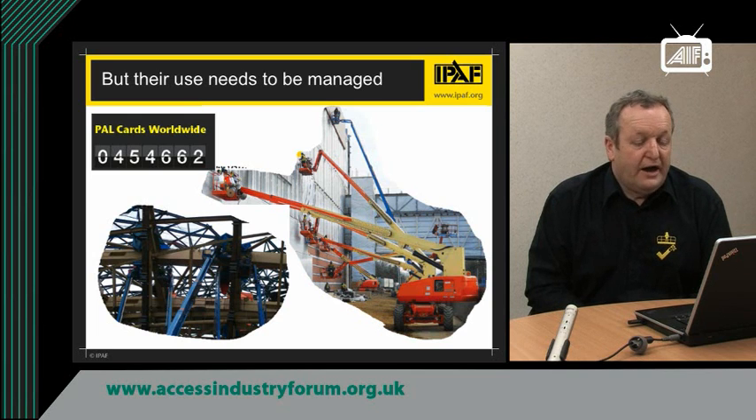The common height of a machine 10–15 years ago used to be about 60–80 feet. It is now 120–130 feet, and just recently there was a machine brought onto the market which reaches 170 feet. That is why IPAF has launched an operator training programme, and currently worldwide we have nearly half a million people trained and holding current powered access licence cards to operate these types of machines.